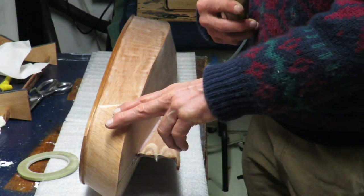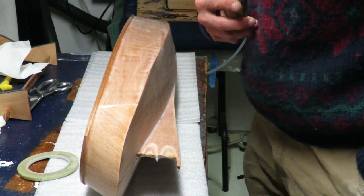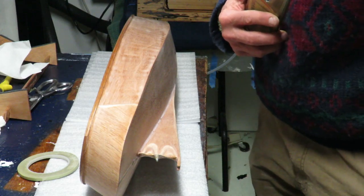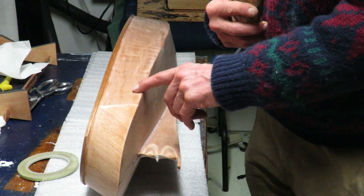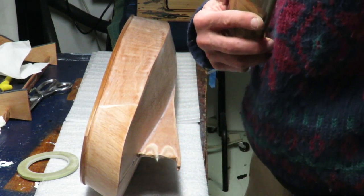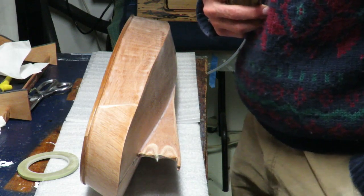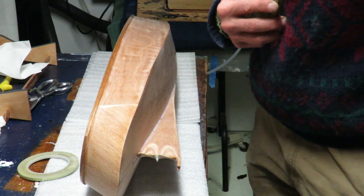Now, you missed a few steps here, but it's easy to catch you up to speed. We did one varnish coat, very, very thin, and then sanded. We thinned that varnish, so it went on really smoothly but did not create a lot of build.